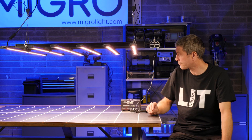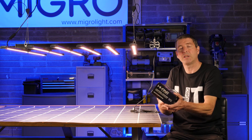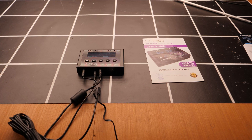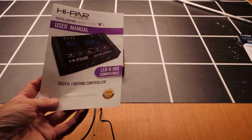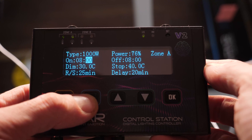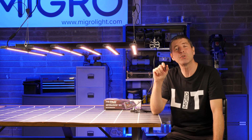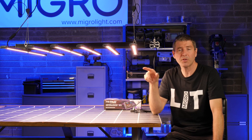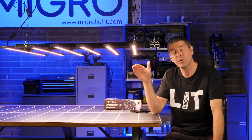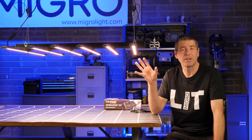It's all very high quality with a nice feel to it, and it goes together very easily and solidly. There are a couple of cool features: for commercial or larger installations there's a high power controller station that can control multiple fixtures in two zones. The fixtures can all be daisy-chained together, which comes standard with the controller package. This control station is capable of operating HPS, CMH, and LED simultaneously. You can set on/off times, dimming settings, and also connect a temperature probe into the grow area, which will dim the lights at a certain temperature and switch them all off if it gets even higher — really nice, very intuitive menu system.